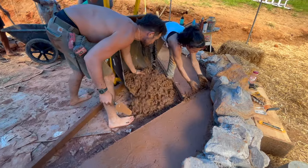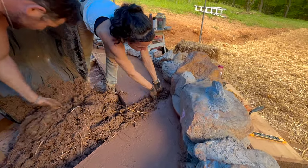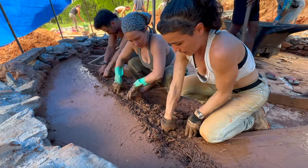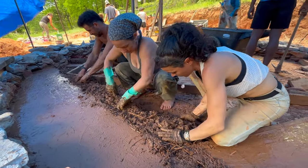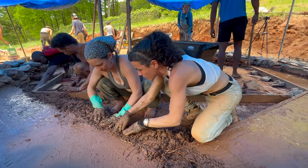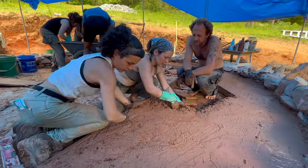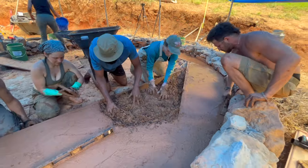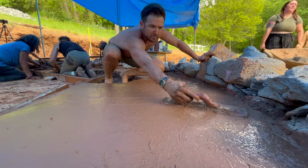An important next step is to fill the gaps from where the screed boards were laying and to thoroughly break down all your hard edges that you can then build back up with new mix. These seams are one of the most likely places that you'll see cracking in the floor if you fail to integrate them properly. We continued integrating the new mix with our fingers, troweling it flat, and removing boards as we completed sections.